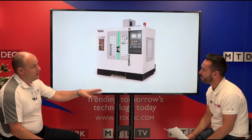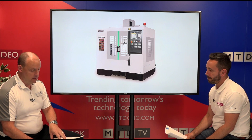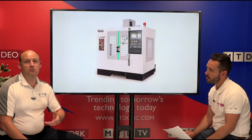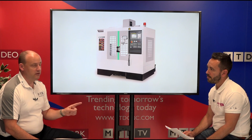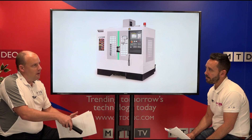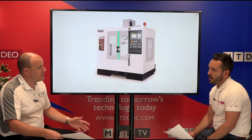It's important to say that the actual strokes on this VMP machine are 760mm in the X-axis and 420mm in the Y. A lot of you are interested in price and we will come to that — it's something worth waiting for because it's very competitively priced. You've also got 510mm of stroke in the Z-axis. So if you have a meter machining centre and aren't maximizing that table, when you make your next purchase, do you need to go that big?